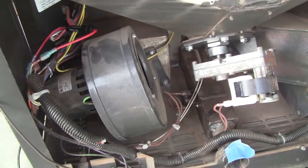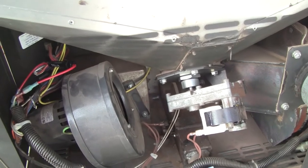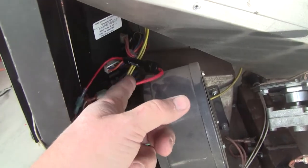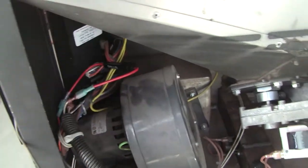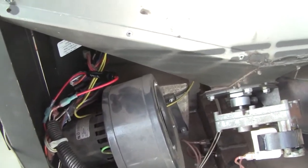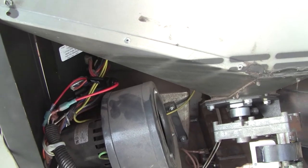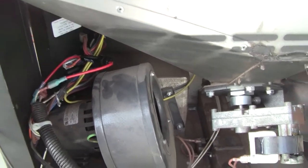Here is the nerd's view of the inside of a pellet stove. It worked at the guy's house that I bought it from. When I got it home it didn't work. It turns out the fuse holder broke in half. This one's a much heavier duty NTE brand fuse holder, holds a 5x20 fuse, and that's what powered up the heater.